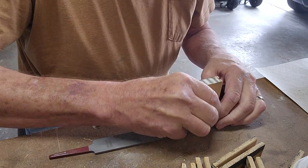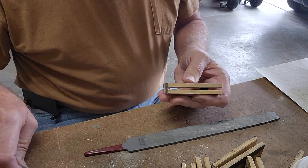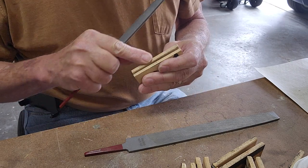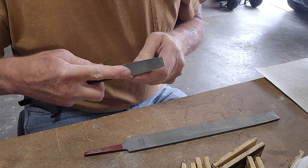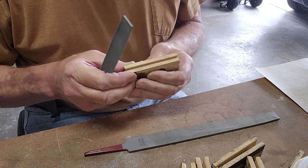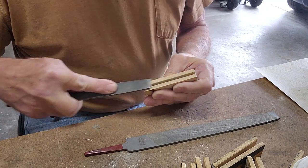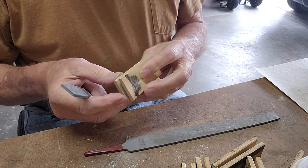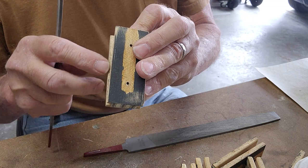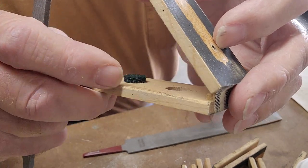We don't want the bellows to crack or anything, so we're going to go along the edges, just making sure that nothing can keep the bellows from getting hung up on anything when we go to assemble these. This is the boring part of the job, just making sure that there's no buildup of the excess glue. Dad beveled the edges here to keep glue away, and as you can see, this one has got quite a bit of buildup along here, so we've got to get that smoothed out.